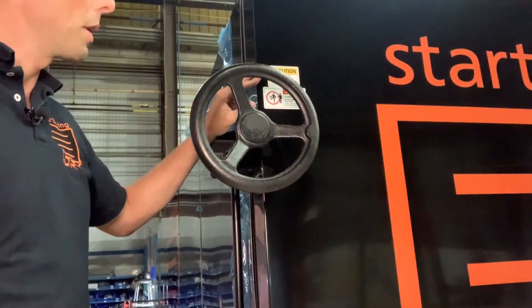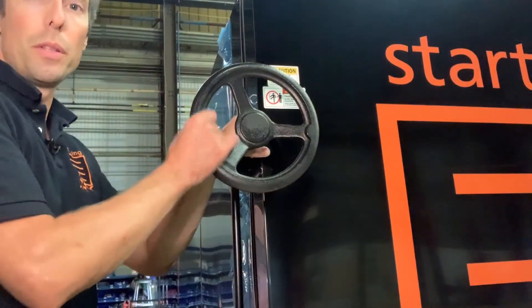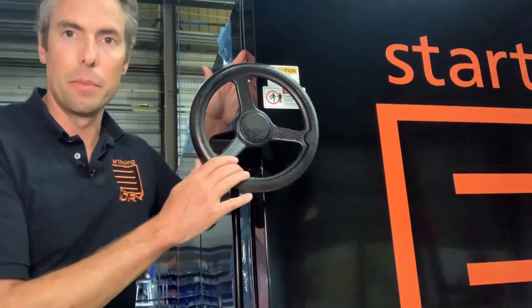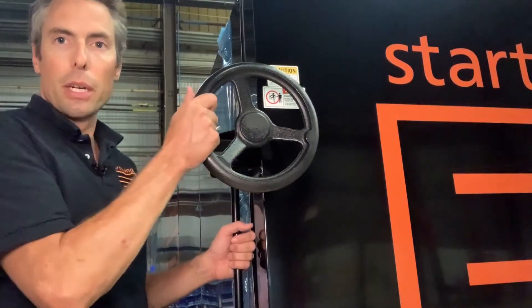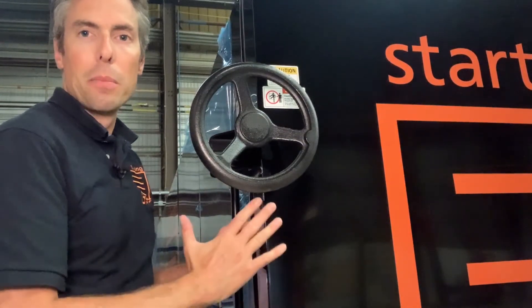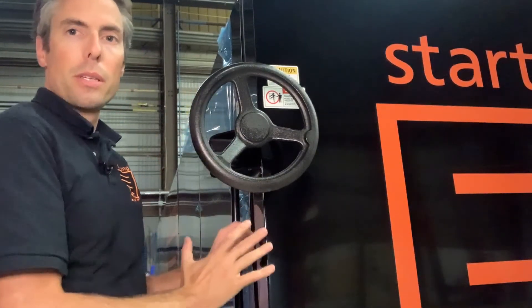Now we have some warnings on the door of the kiln to not over-tighten the hand wheel. Once you've made the door seal — in other words, it is sealing vacuum tight — there's no need to tighten the hand wheels down anymore. In fact, once we've drawn a vacuum on the chamber, the hand wheels are going to get pretty loose because the door seal compresses just by the force of the vacuum pulling this door in with a tremendous amount of force. Once those hand wheels loosen up, the door is already sealed.